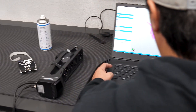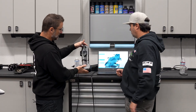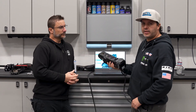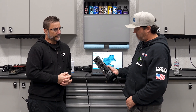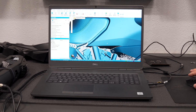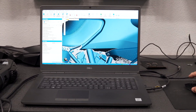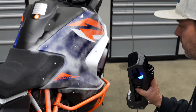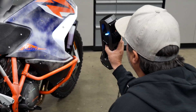This is Craig Hall. We tapped Craig to come in and help us get our scans done so we can build those point clouds and start designing products. So Craig, why don't you help explain exactly what this is and how we use it. So this is a Creaform — it's a Creaform Spark white light scanner. On the screen, you can see we've started getting some surfaces on the bike, and we have targets already on the bike to help with the stitching of the scans.